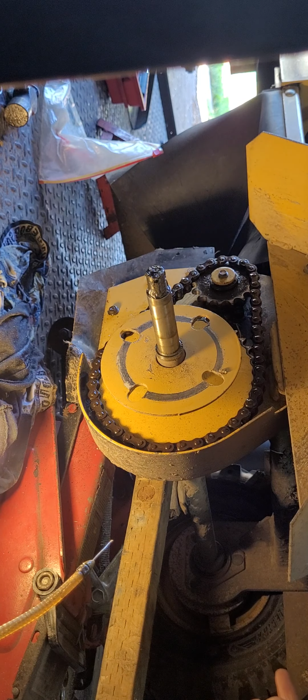Now don't forget, we got to go in the back there. I'm not going to go back there again. All you got to do is take that 9/16 and 3/8 back there with you and push with the 3/8 very slowly on the lock bolt and then tighten the lock nut.